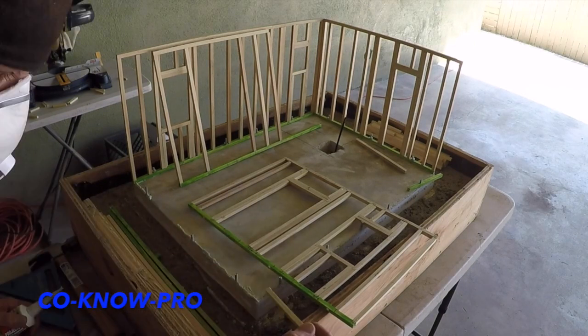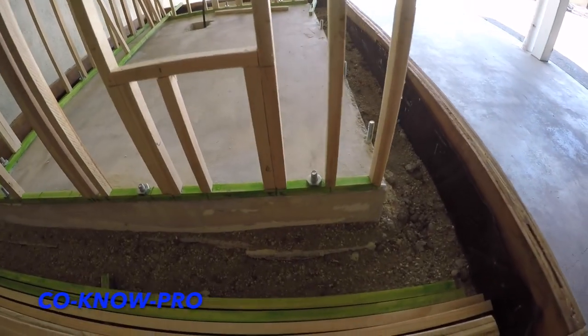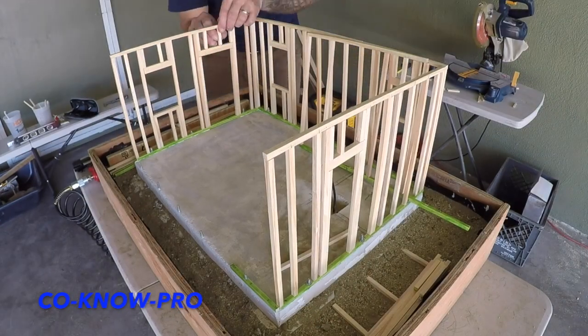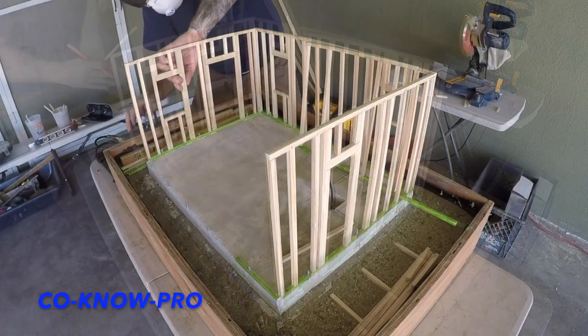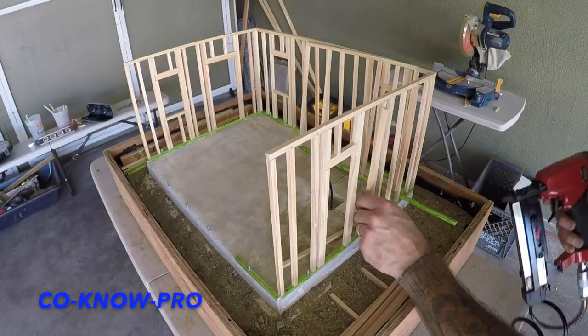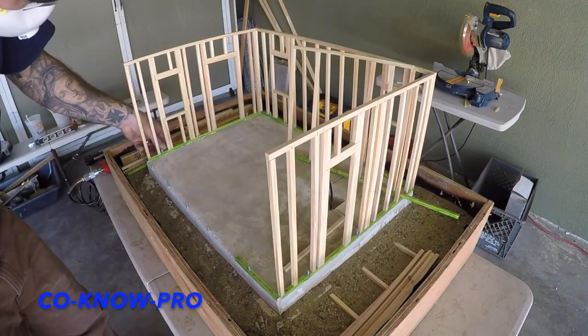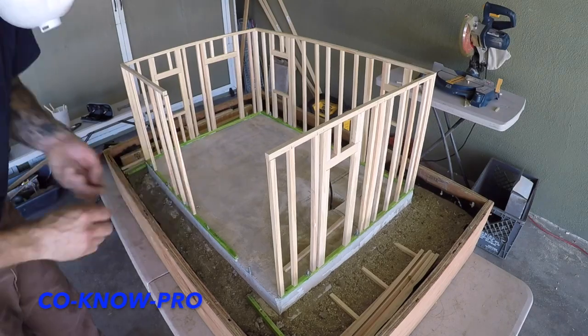This structure is coming together really well. We just applied adhesive below our bottom plate and tightened down our hold-down. You can see the layout, the king studs, the trimmers — there's going to be a stud right next to that hold-down that we'll have to notch, which we'll install in a second. Remember everybody to share this video and subscribe.